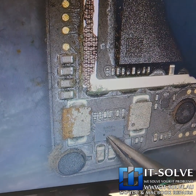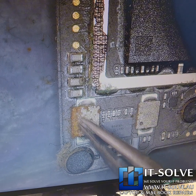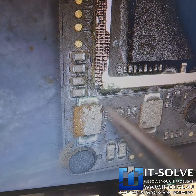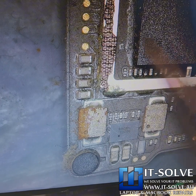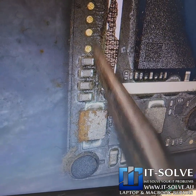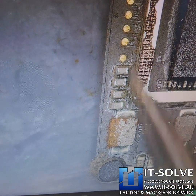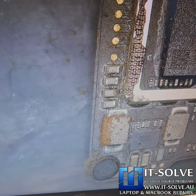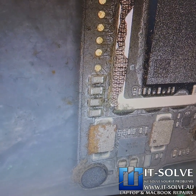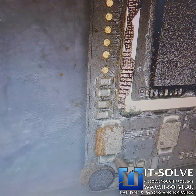This is a voltage regulator which takes a high voltage — probably around 15 to 19 volts — and drops it down to 2.5 volts. It's essentially a step-down buck converter which feeds the SSDs. You have some filtering capacitors here and a metal shield, which is also oxidated. Most likely we are dealing with a blown SSD, which would mean nothing we can do to repair the machine. However, we'll do our best and measure the resistance on this line.